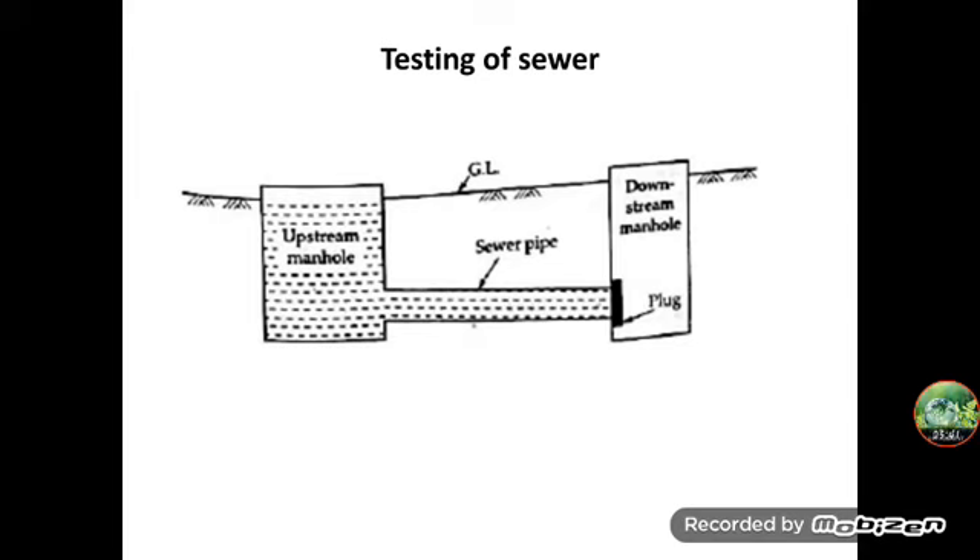After testing, the sewer line is backfilled — that is, the trenches are backfilled. While backfilling, the excavated earth should be laid equally on either side of the trench. The earth should be filled in layers of about 15 centimeters thick; each layer should be properly watered, tamped, and rammed. Earth filling above the crown of the sewer pipe should be carefully carried out by shoveling in layers using selected soils. After a few months of exposure, when the top layer is fully settled, road pavements may be constructed to prevent subsidence and cracking.